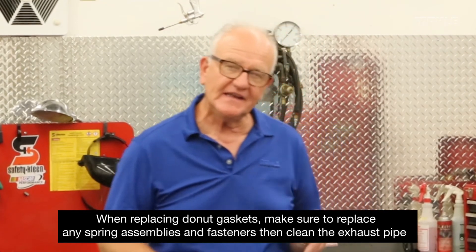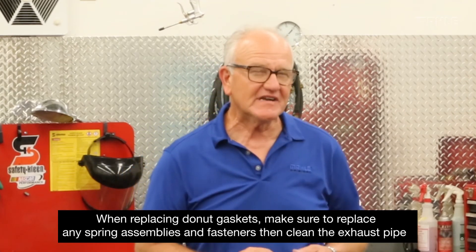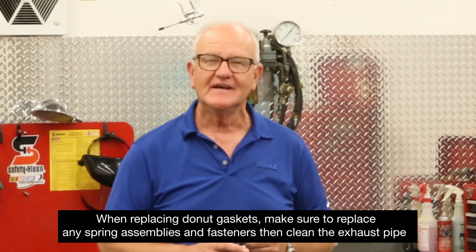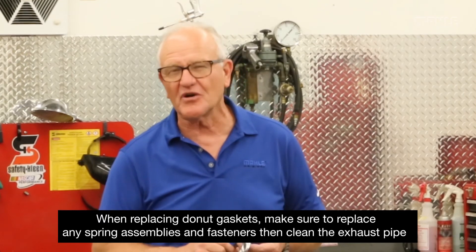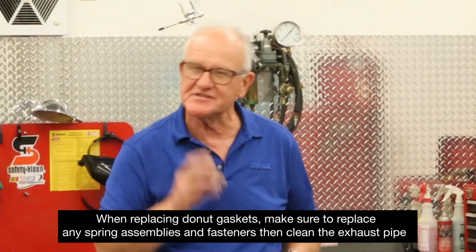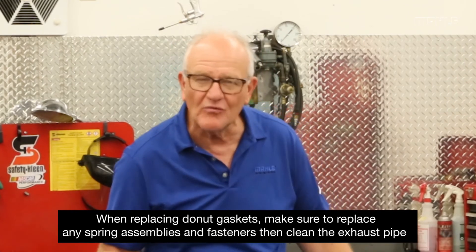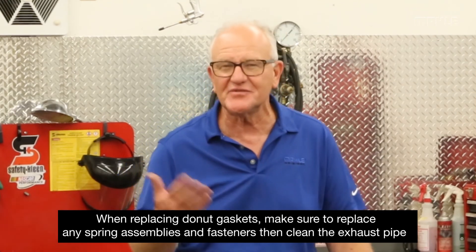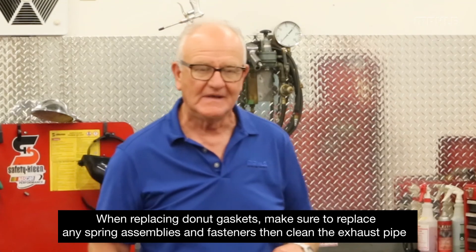Before you install the graphite piece into the pipe — even though the pipe may have been changed two, three, or four times — it is in your best interest to clean it off. Even with steel wool, make it extremely smooth, because if it's rusty, bent, or has corrosion sticking out, it might end up tearing or gouging the graphite. Take a wire brush to it and clean it off so the surface is as smooth as you can get it — it doesn't have to be a mirror, just be logical. Get yourself some springs and fasteners, and you can add more life into one of those swedge gasket applications.